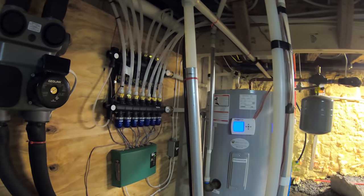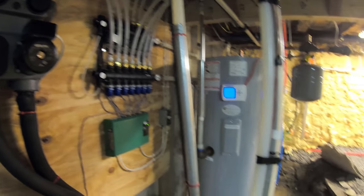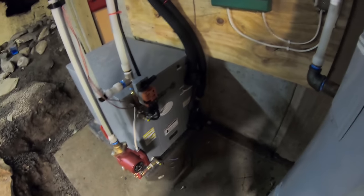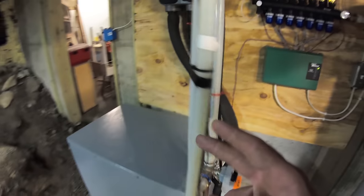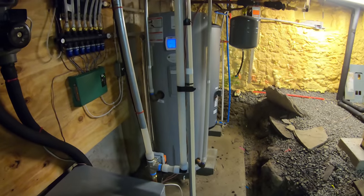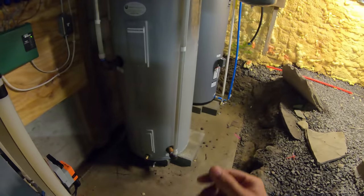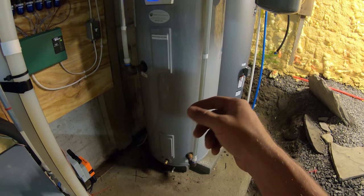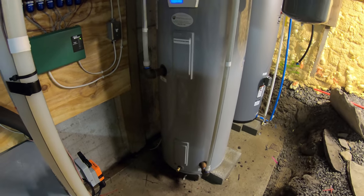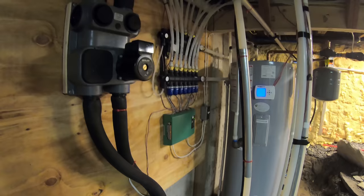Like in my house where I live right now, I actually set my house up to use geothermal, and I actually set it up to use cooling for the geothermal too, because I actually have one of these units right here, and it's a water-to-water unit. And basically, I set it up with fan coils to each location in the house so you can have different zones for the cooling. And those fan coils have a condensation drip pan on the bottom with a drain, because whenever you're cooling air, it's going to create condensation. So you need to make sure that you take all these measures so that you don't have water just in random places in your house rotting things away.